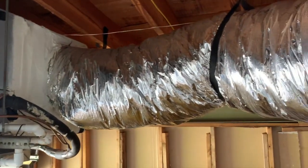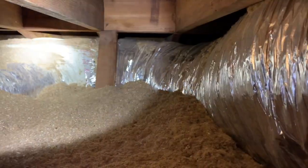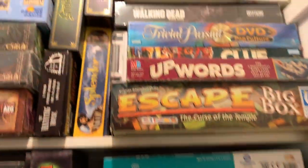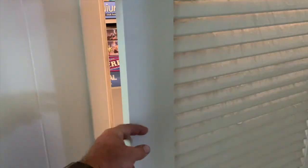Here's the system. We've got a 14-inch duct there — it's four tons. Another 14-inch duct here, a couple more back there, but there's not enough ducting for this thing to work. This is our trunk line going into an existing sheet metal system. Here's our return duct — it comes right in here and turns and goes right into a closet. And when you close the door, it just slams shut, so there's not enough airflow through this door.